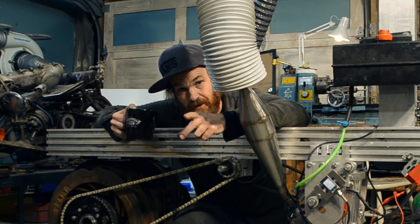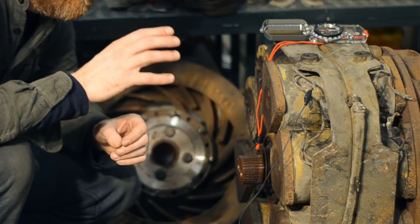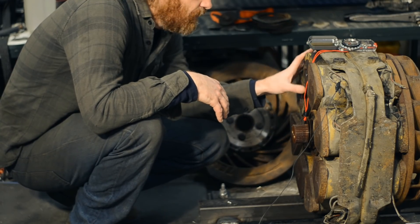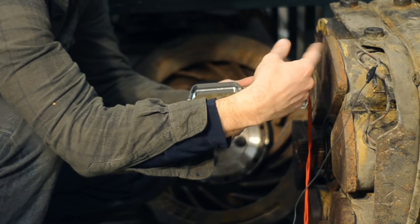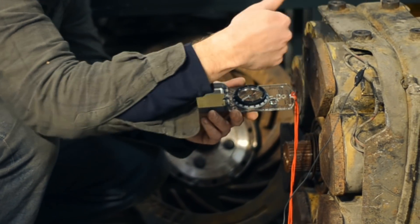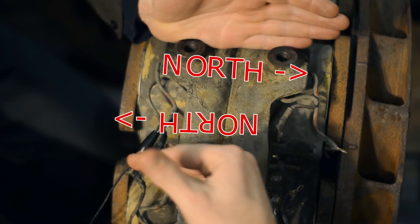We're starting this thing today — it's not a joke. Just a little while after posting that previous video, I realized I can just leave these coils out. We'll have plenty of torque regardless. Wish I would have realized that sooner. Time to start wiring. Now I'm going through all the coils, figuring out how I'll need to hook up the wires to get north and south in the direction I want — alternating pattern, north-south.